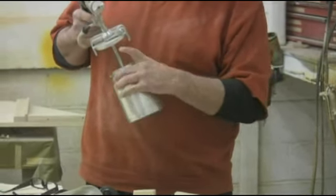Now the BIN has shellac in it, okay? So yeah, it's flammable. And you can brush it, thin it a little bit. Now if you're going to brush the BIN, you want a good natural hair brush because it's shellac base or solvent. If it was a water base, you want to use a synthetic brush.